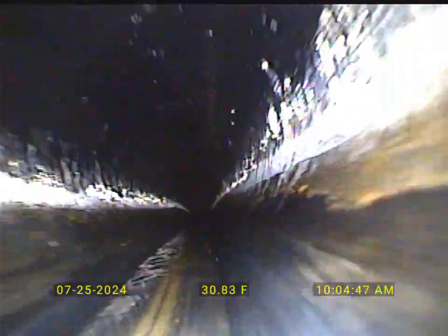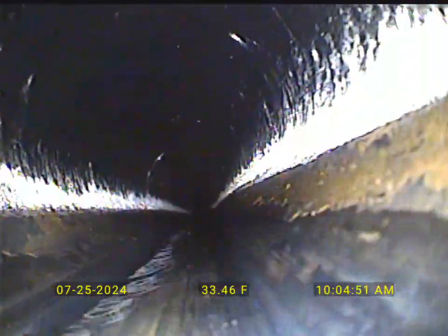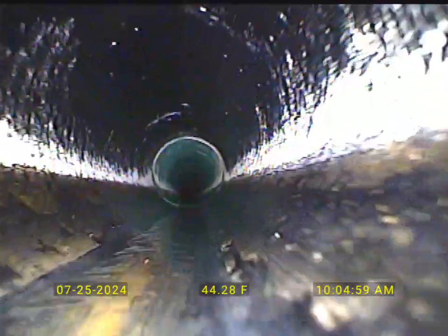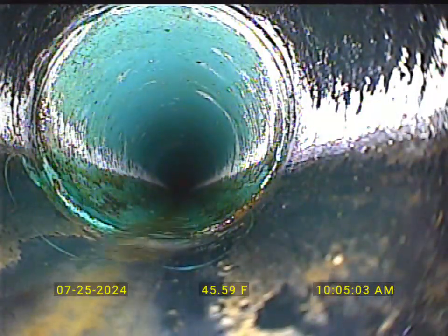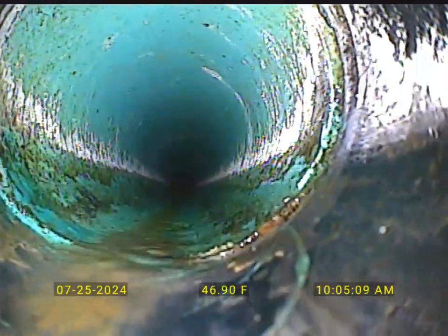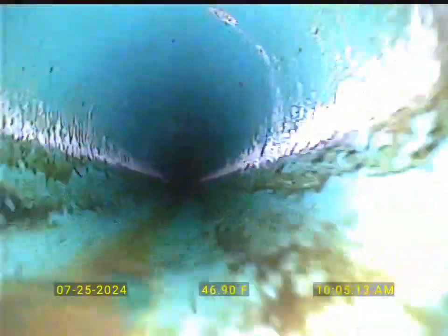Bellies in the line — those are low spots. I do have water running, so I'm checking for flow at the same time. Then damage — the other common issue — like offsets in the pipe where two pipes are misaligned. If the green pipe were higher at the bottom than the black pipe, that would cause damming and clogging, and that would be no good.